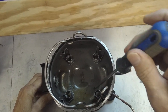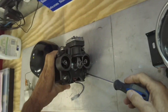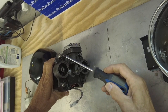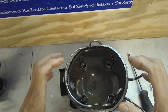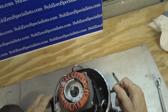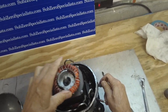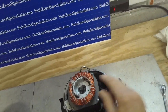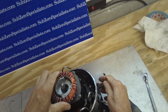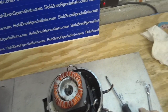Here are four springs and here are four pillars. These pillars, or posts, sit on top of those springs, and that's what reduces the vibration. So if you're driving around in your van transporting a compressor and you hear something knocking around, it's this unit banging up against that ring. But it prevents it from flipping over — sometimes a compressor is turned upside down. That's what that part does.